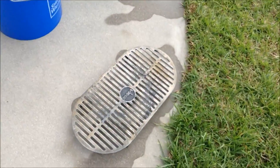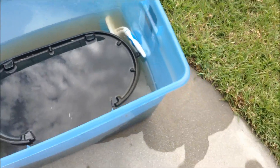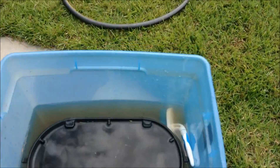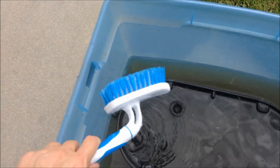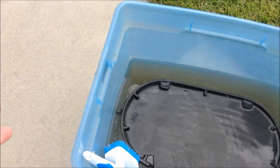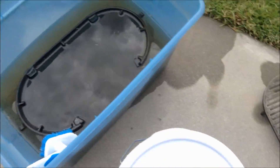I have emptied all the old water; this is new water. The reason it looks so brown is because after the electrolysis process, you need to scrub the cast iron and the steel — that's only to get the rust residue off. The rust won't completely come off on its own. What it has done is unadhered from the cast iron, but not necessarily completely pulled off and gone to the positive electrodes. Just use a little bit of steel wool and a plastic brush to get off all that rust flake, and it will be raw cast iron or raw steel after that.